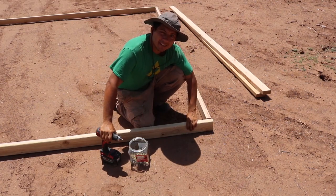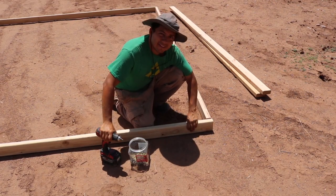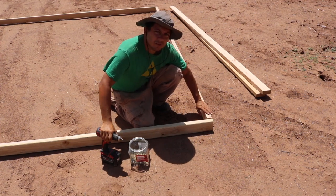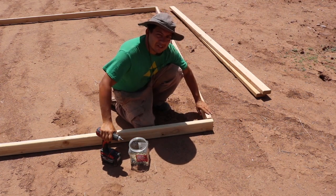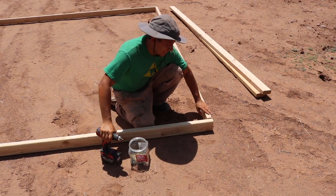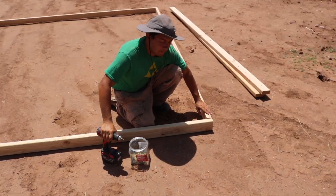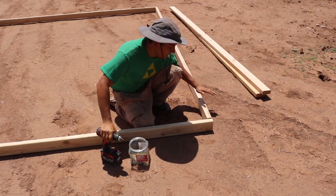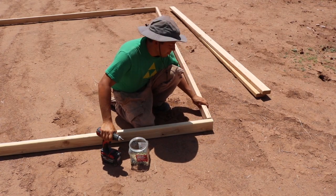This right here is my 10-foot length of 2x4, and it is going to be on the side closest to the post. These boards were 12-foot boards that I cut down to 10 feet 10 inches, which compensates for the length of the 2x4s on the other side, and it should fit the panels perfectly.